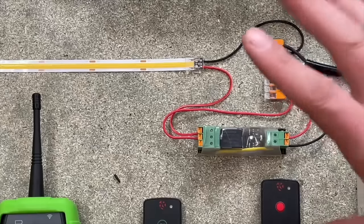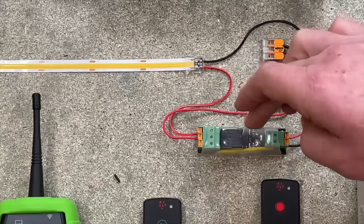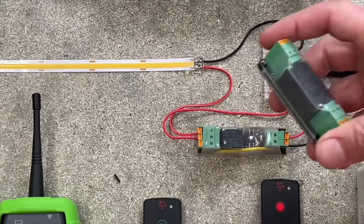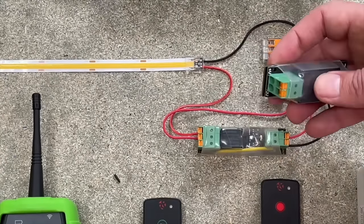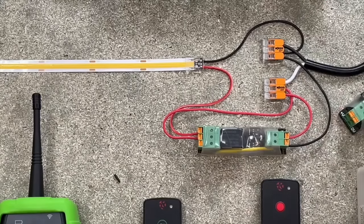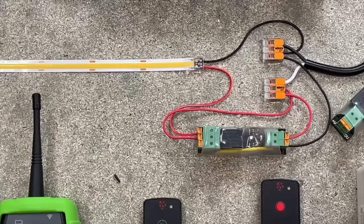This is set up for low voltage. If I wanted to do mains voltage switching, I'd still power the module itself at low voltage for its working electronics. RF Solutions have created this handy little power supply to do that - it takes mains input and provides a low voltage output that connects into the input terminals. That's a great option if you want to switch the primary side of an LED driver, which you may need to do when working with constant current LEDs.